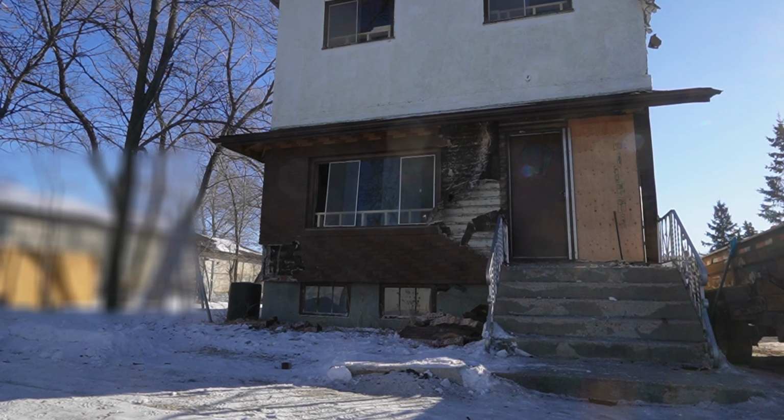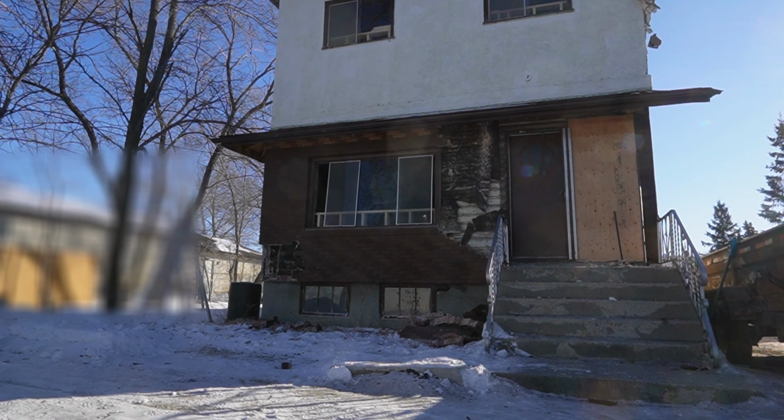If you look through the window, you can see Garrett taking the panes of glass out. And also there is some wood pieces. That is actually the framing of the bottom of the window. So the window will be slightly higher than it used to be. Don't you worry, we are not making the window smaller. The top will actually go higher than that eyebrow that you see on the exterior, which is another reason why we're getting rid of that eyebrow.